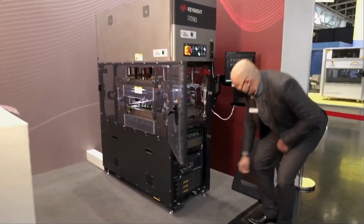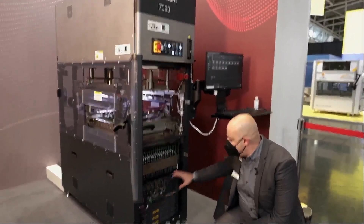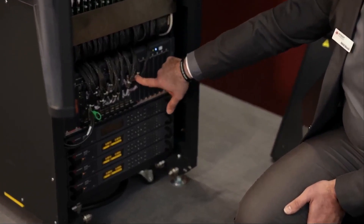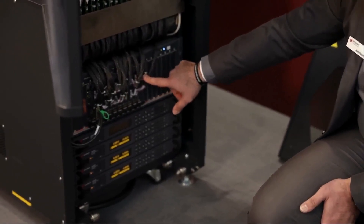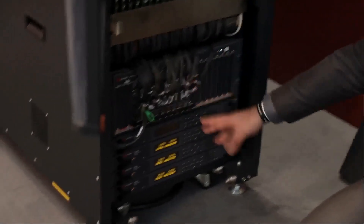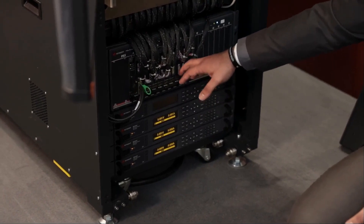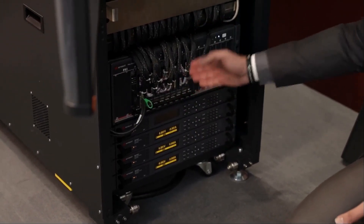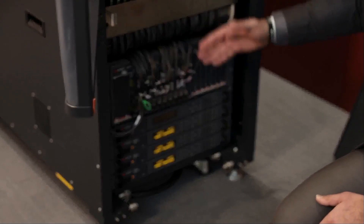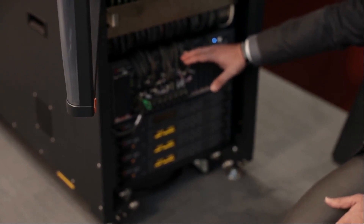Jason, if you can just come closer. The system architecture is a PXI-based platform. You see your PXI chassis with the different modules inside. Each of these modules has the analog measurement card — it's called the Vectorless Analog Measurement card, or VAM card. Each VAM card has two modules for measurements. If you make the count: one, two, three, four, five, six, seven, eight, nine, and ten modules — ten multiplied by two, which makes it a 20-core system. Which means if you have a panel with 20 DUTs, you can test these 20 DUTs in full parallel, thanks to the measurement cards.